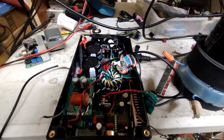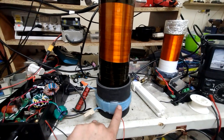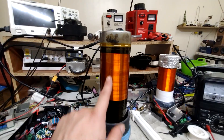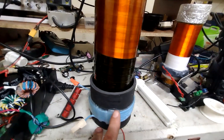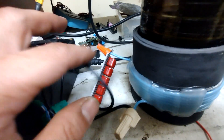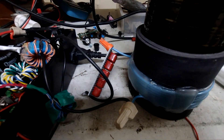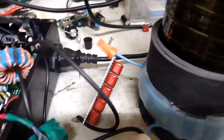This is Steve Ward's SSTC1 with the OCD on it. I wound this primary to be a higher impedance primary to run continuous wave on my PLL setup sitting in the chair over there. Right now I'm just using it as a test primary on this coil. These are 400V CBB capacitors — I've got rows of five, so basically 60nF on the MMC.